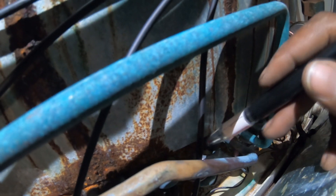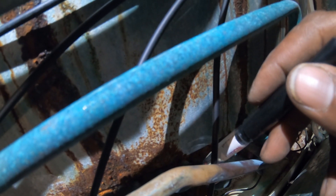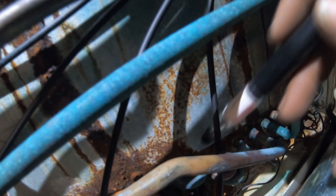Like I said, I'm going to try leak checking before. The bad part about this is I haven't hooked my gauges up outside, so I don't know what kind of pressure we have. It's just very low or none at all. I think they said it had something in here that was just low, but if it's too low the electronic leak detector will not detect.